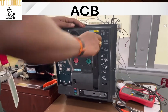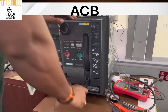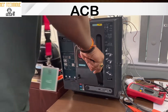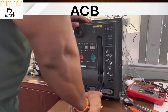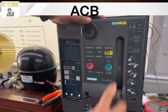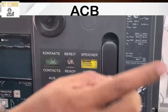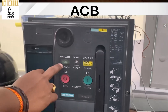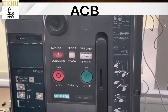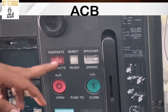You have to move the lever from up to down to charge the breaker. There is no fixed number of strokes — you need to check the indicator. It will be a little bit hard at first, and once it is fully charged it will become very soft. See now I can easily move the lever. You can also see the spring-charged indicator has now changed to 'charged.' Now I am going to operate the breaker — the breaker is in open condition.